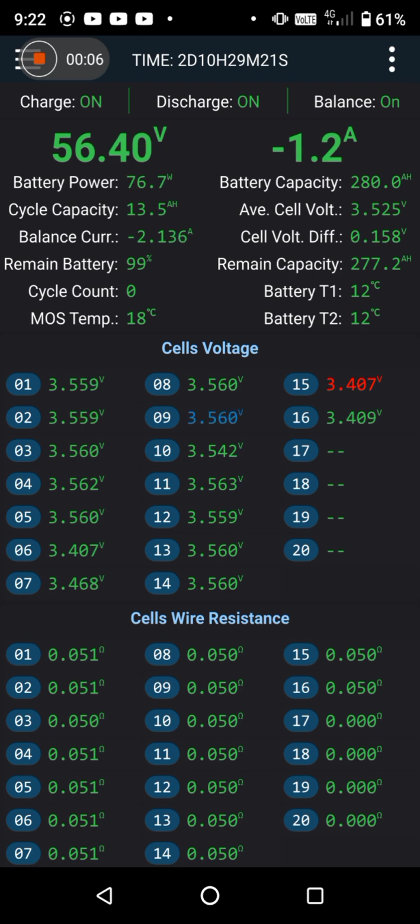That's the cell deviation ticking down slowly. The pack voltage is ticking up slowly. Just about the amp trickling in. And all of the cells now are above 3.4. The last three sleepy cells have ticked up over the 3.4. So it'll be quite quick from now onwards, I would have thought.